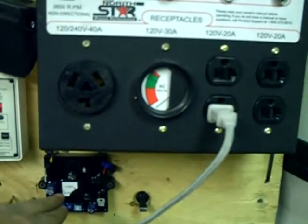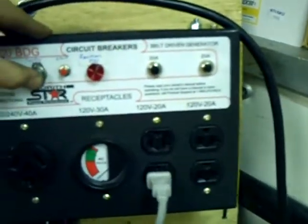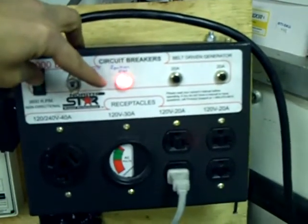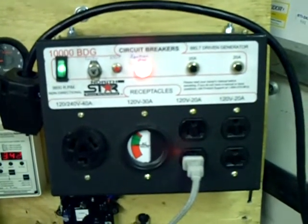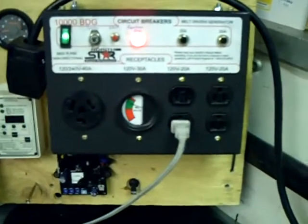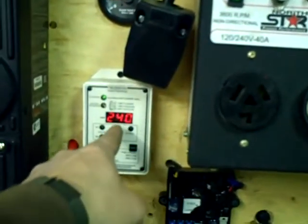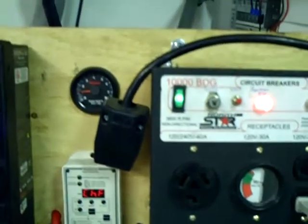And then right here, this is the governor for the engine mounted generator, and then here's the control box for the engine mounted generator. I've got a breaker down here so I can connect the solar battery array to the alternator, which also boosts up the battery of the truck so it starts a little easier. So to turn things on, I hit ignition here and then start, and generator fires up and the governor equalizes it. I have to keep this little electric heater plugged in as a dummy load so the governor sees the current and knows to regulate the generator. Also, if you'll notice, when I turn that on, we're now charging at 236 watts because it's coming off the alternator of the truck. So on sunny days and while I'm welding, it's always charging.